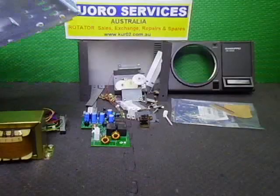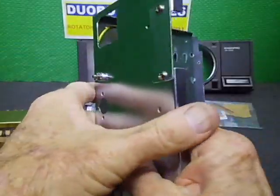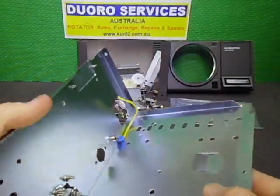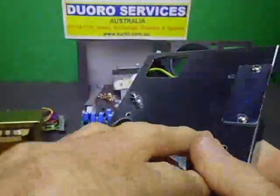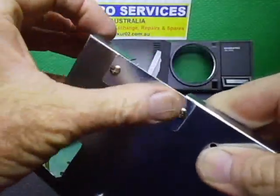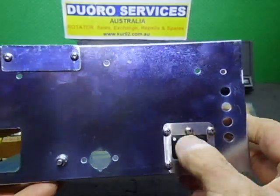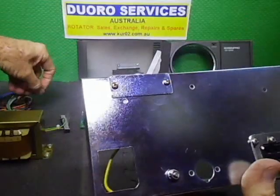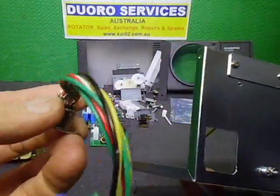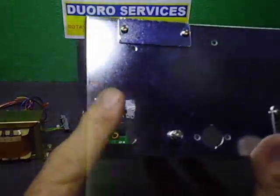The original chassis had flared-out parts and was painted and in poor condition, so I've had it chemically cleaned and then re-zinc-plated, including the little cover plate. I've been putting it back together — a new cinch socket is going in here, and the remote socket will be going in there. There's also an earth bolt and an IEC socket which I'm waiting on.